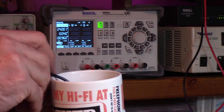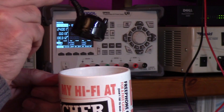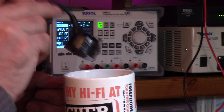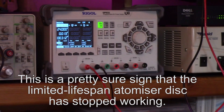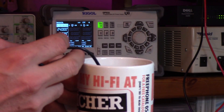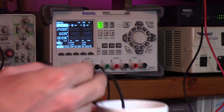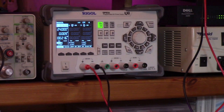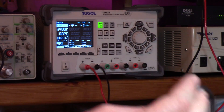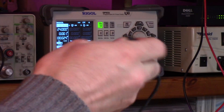So when I drop it in water, you can see it starts to flick the current between 13 and 40 milliamps. But when it's not in the water it just sits at 13 milliamps. And the other one, that I think stopped working a longer time ago, does exactly the same thing — 39 milliamps and 9 milliamps. So they're not totally dead but they're not making any fog. I'm guessing the electronics still works but the transducer stopped, or something along those lines.